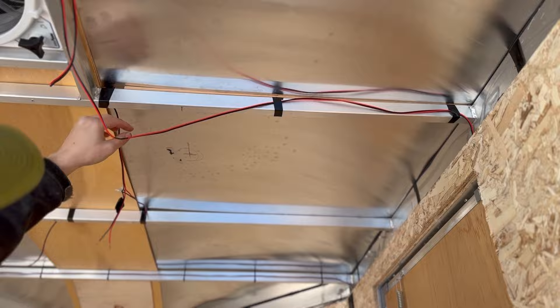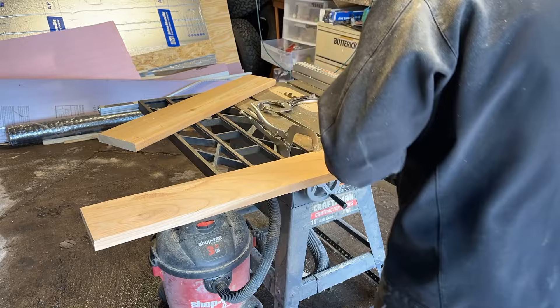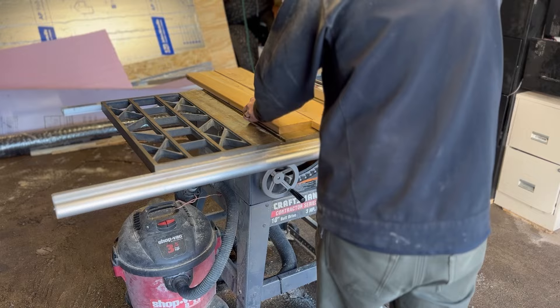Here I am making a jig to make shims on my table saw. I'm using some leftover red cedar from the roof deck project. Using a jig saw I cut out the first shim to my specifications — I didn't start the cut on the very end of the 2x6. Once the 2x6 is placed flush with the saw blade, I place a second 2x6 against it. The first board acts as a pusher for the second, and with every pass a new shim is born.